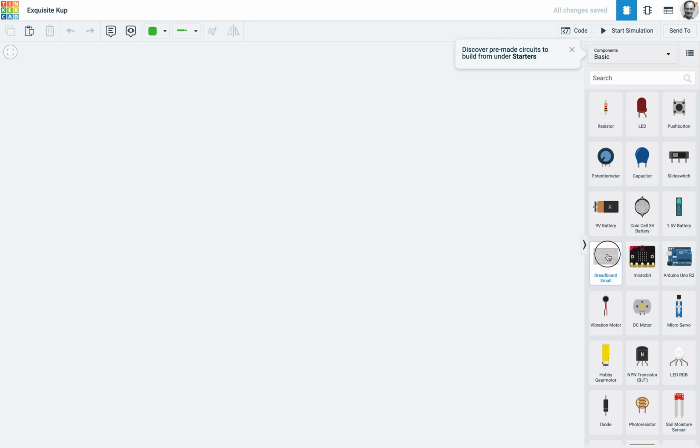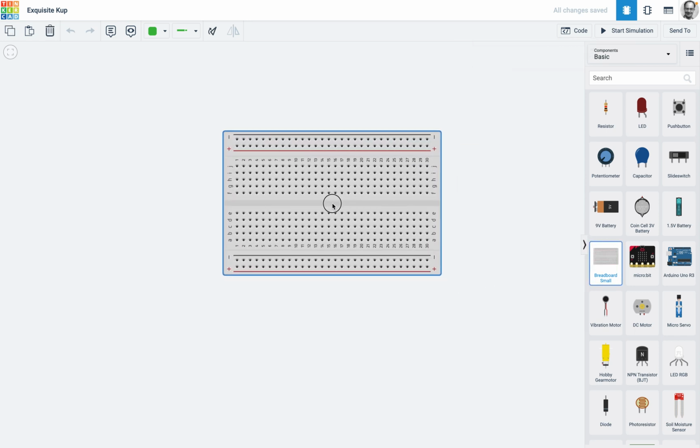to simulate stuff. So I'm going to drag the breadboard in. Now, if you looked earlier on the theory notes, you can actually see that these columns here, they're all connected, okay? And they're all connected, but they're not connected to each other because of this groove. And the power rail is connected, and the power rail is connected, and as are these and these, but this obviously is not connected to this.